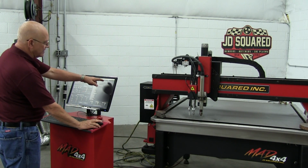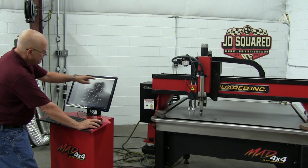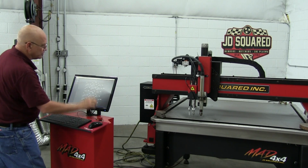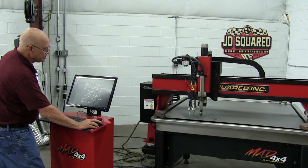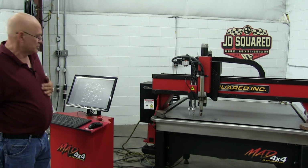Let's go back to settings. This time, let's pick attachments on the left side. And up here, you'll notice this is scribe, this whole box here. The lower box is marker. All we got to do is go in the scribe button and click the button, get offset. Offset's changed. The machine now knows where the scribe is.